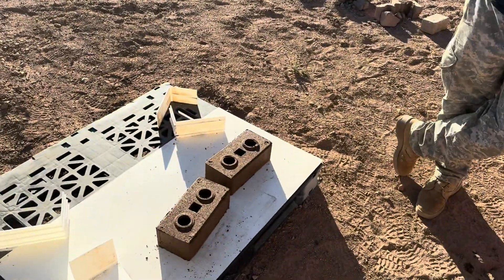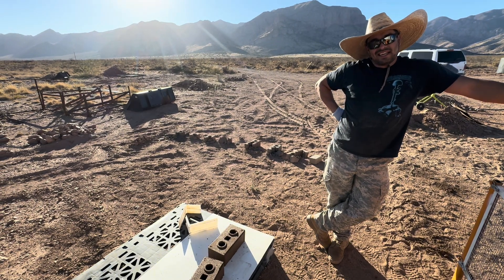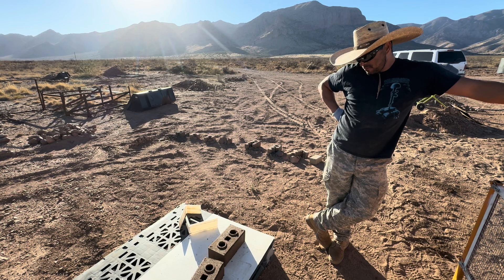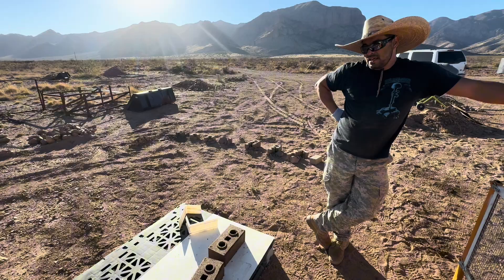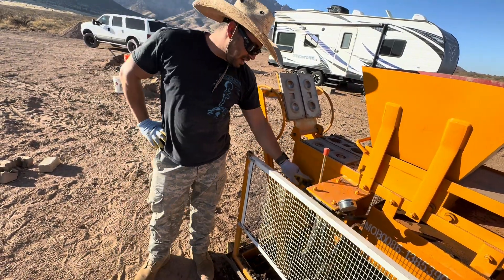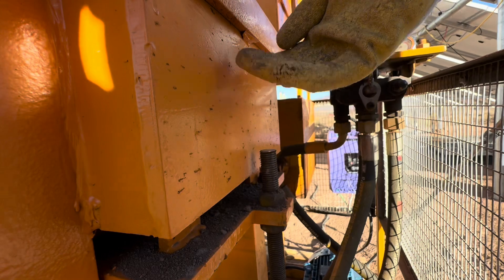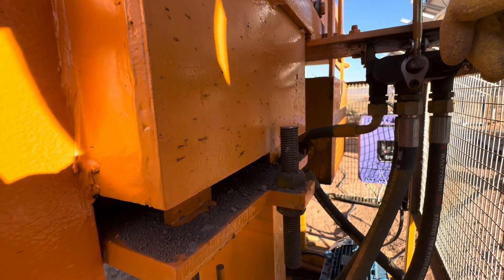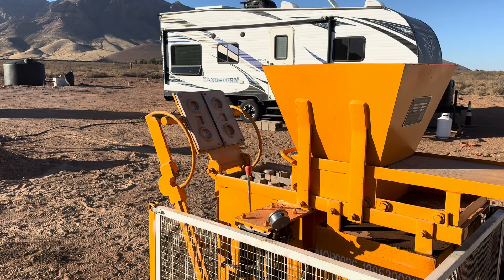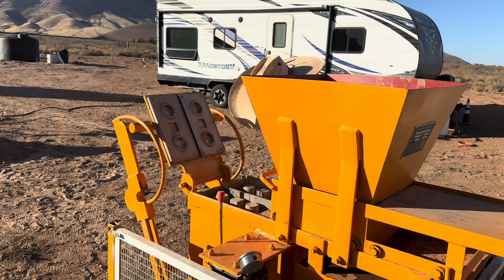I think somewhere in between is where we need to be — now it's too wet. Eric's brother Chris told us to put more soil in it, or since we have a 3D printer we can make a little spacer to compact more. But we have an adjustment right here — this part determines how high the plate pushes, which sets the brick height and the amount of compression. We might try adjusting it down by half a centimeter or an eighth of an inch, so this will be the one in between the wet one and the dry one.